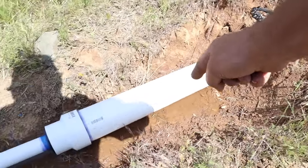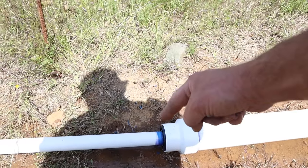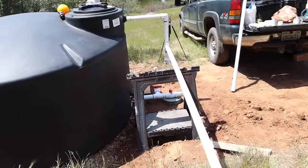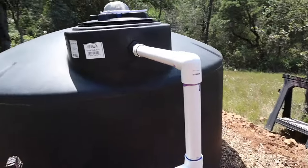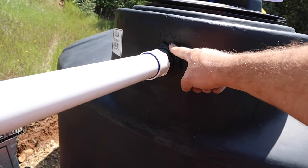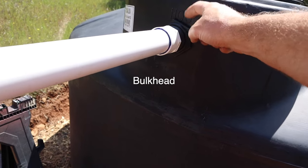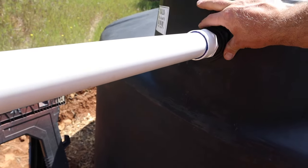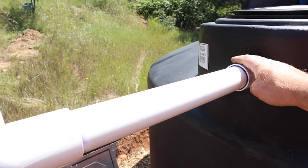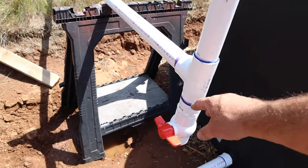Anyway, I did a 4-inch little pipe here to get me out, and then a 4-to-3 reducer, 3-to-1.5 reducer. Little 1.5 pipe running up here. The reason I went 1.5 is the, what do they call them? Not petcock. The fitting here, I'll remember it, in the tank here was 1.5, so I just figured might as well do full port all the way through. Male slip thread here, 90 down. I did put a shutoff here